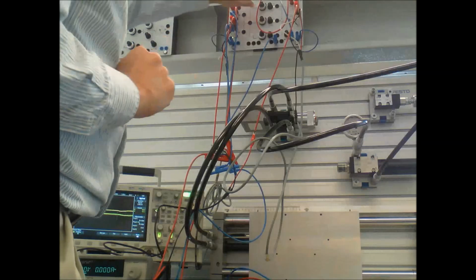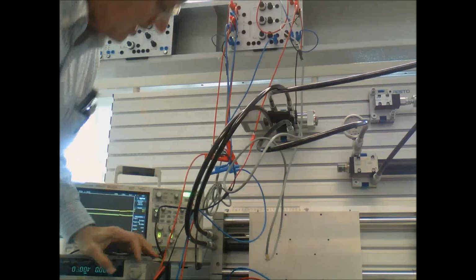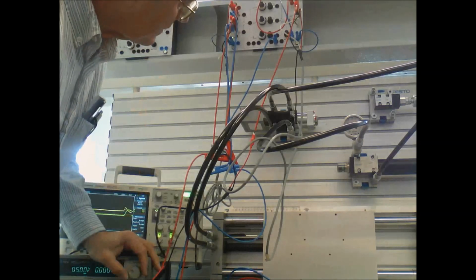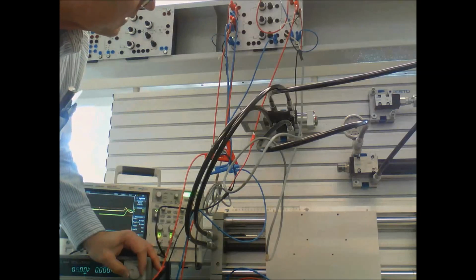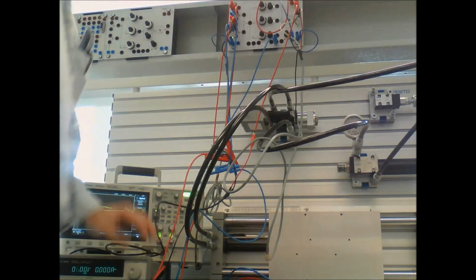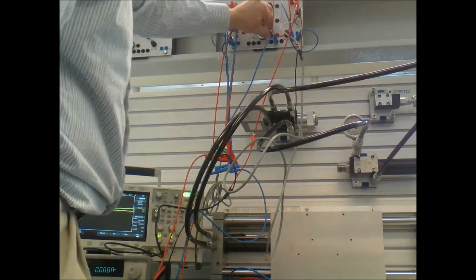And if I want to turn on a little bit of integral, just a teeny bit, gain down, I should be able to. Now even then, see, it's overshooting and oscillating because it's essentially behaving like a double integral. So if I turn that off, let's turn on derivative gain.